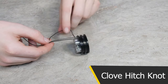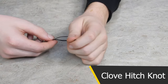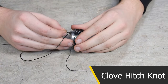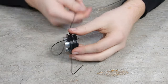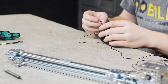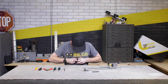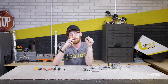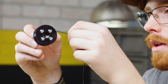I am by no means an expert on knot making, but it is a fun hobby. You'll notice that this knot can slide freely on one end of the string. What you'll do is actually run your cable — we're going to unspool all of it right here. Find the other end and run it from the outside of the pulley, through that flange, and pull it all through. When you get to this point, slide your clove hitch until it is pretty close to the side of the winch pulley. Get it snug with the flange of that winch pulley, then pull the working end — previously the static end — tight. You've now got a really secure knot that exists on the outside flange, leaving all this room in here to run your cable.